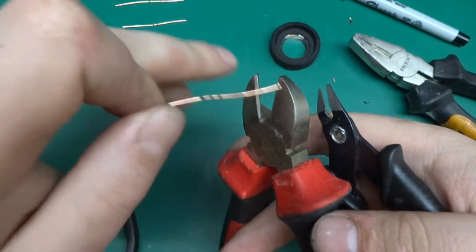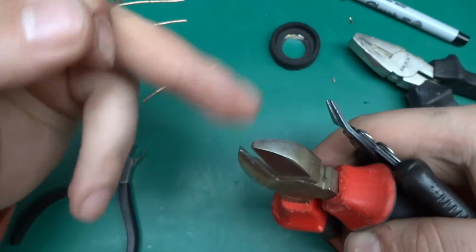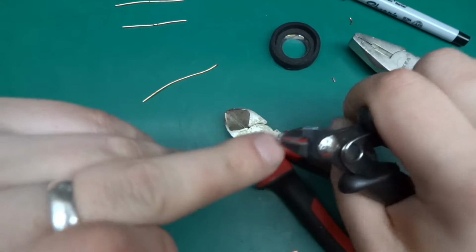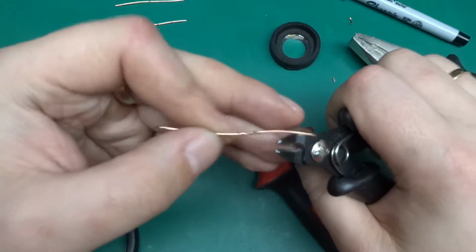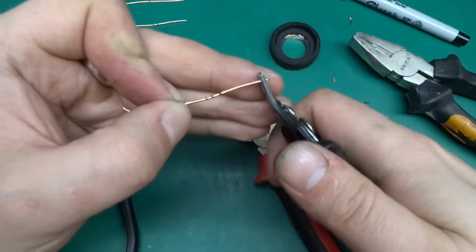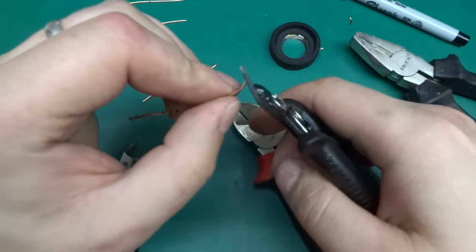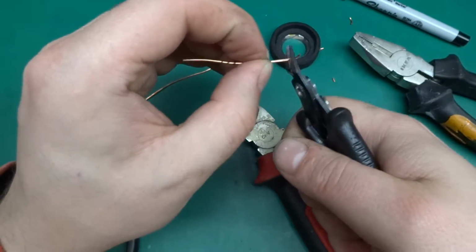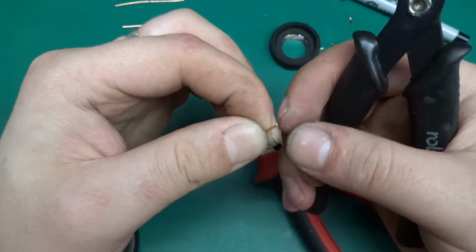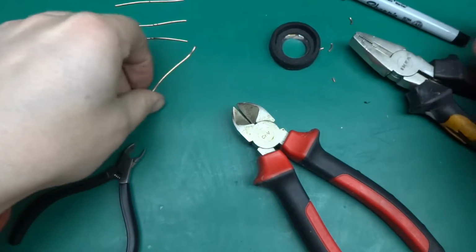the blade is angled on both sides, so the jaws bite into and push the material either side of the jaw. On here, one side is completely flat, and the angle is on the other side. So technically what this should do is produce on the good side, where you're cutting it off, a nice flat, nice flush cut, and what you're cutting off is really not important. So yeah, it did a somewhat decent job, but I can still feel with a finger that there is some sharp corner.